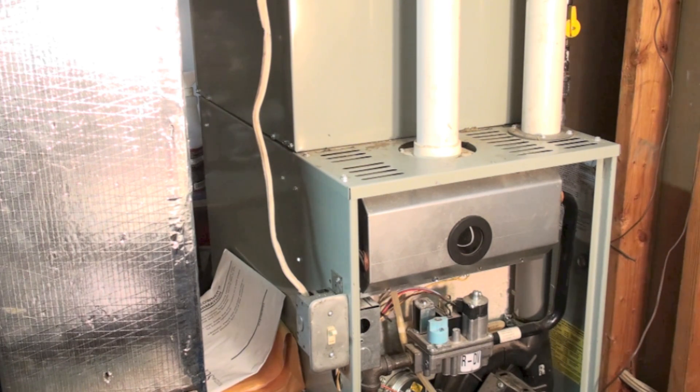A good example of this: if you have a fireplace and you light a fire in it — no doors, just a big old fire — you're burning the fire and it's all nice. Then you go back to your bedroom and it's colder than you'd expect. The first thought is the thermostat was near the fireplace so you shut it off and the furnace didn't fire because that room never got cold. But the rest of it is you are drawing so much air from the house — a fireplace can draw up to 400 cubic feet per minute out of a house. If you draw that much air out, it has to come in someplace, and it's going to make cold, drafty rooms.